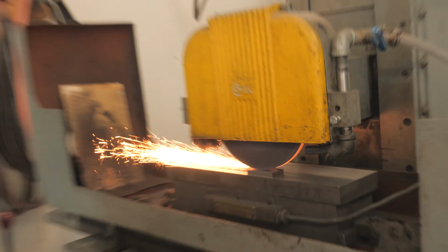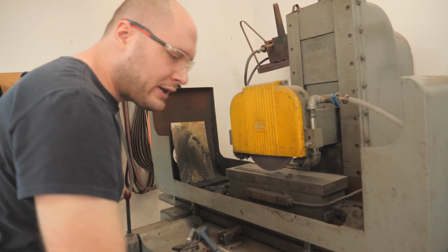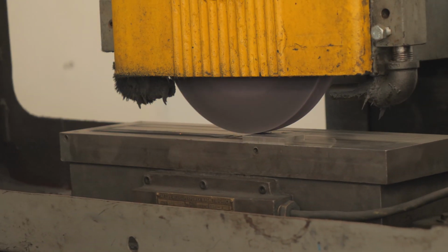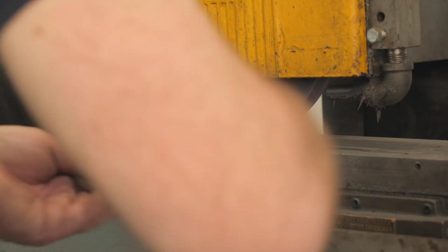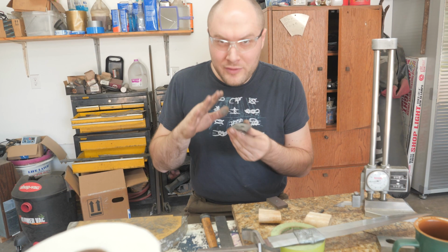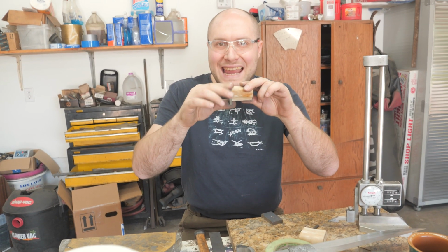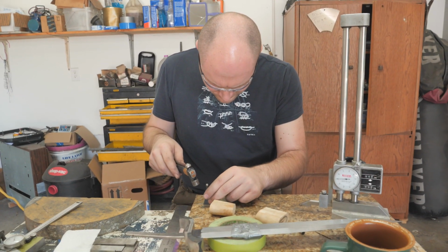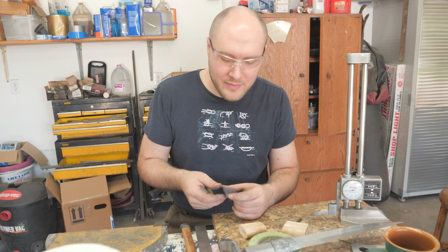I decided to go ahead and surface grind the pommel while I'm over here, and I have the surface grinder already going. It's important for me to surface grind the pieces so they'll be nice and flat and everything will fit up nice and tight. I like to make little marks on my parts so I know which way they go on every time. Until I get the lineup pins in there, the parts could possibly go on the wrong way or something and they won't fit as good.